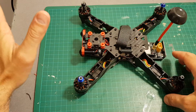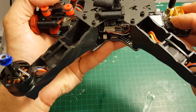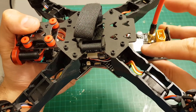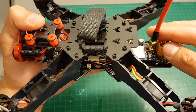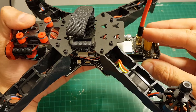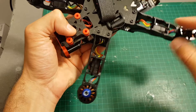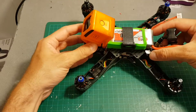Before taking it for a test flight, I'd like to give a couple of tips. First, I recommend using a pigtail because the VTX antenna connector is very fragile — in a crash it's going to bend or break, and if it breaks the VTX is probably toasted. Also, make sure not to power on the quadcopter without an antenna or the transmitter will burn. These arms are made of plastic so they'll likely break, but they're easy and cheap to replace — if you buy this quadcopter, make sure to buy at least two spare arms.